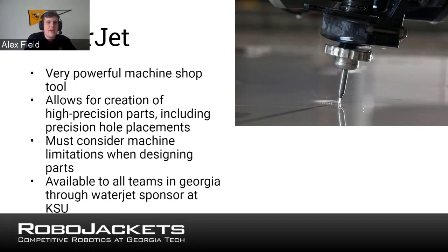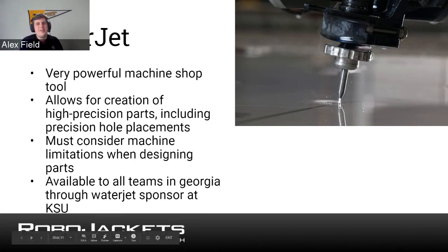But one of the other big advantages to it is rather than just drilling with a mill, there are specific tools called end mills where you can cut horizontally. So essentially, if you have your part here, you pass it along and it takes off material and can cut pathways through the material. So that's an advantage mills have because they can move to the side. Now that is not a requirement for a lot of FRC things you are doing. However, if you have it, you can design that in to be done. I just don't expect people to have that.